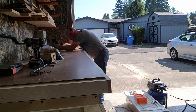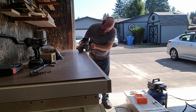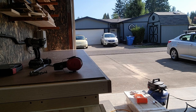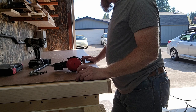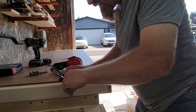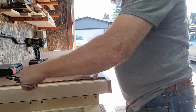Time to ease this corner on the edge banding using a 45 degree chamfer bit in the router. Just adjusting my depth, and working my way around the end. Over here I have a little gap because of the length of the MDF and the overhang I wanted — about an inch or so. I measured it and cut a small spacer piece to fill in there. Just a small one inch piece, and got all that squared away.